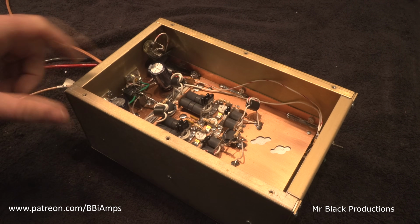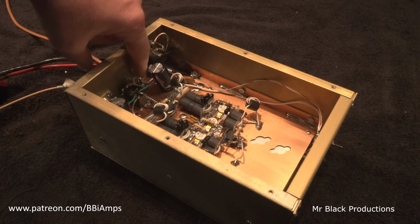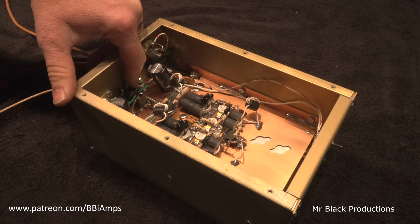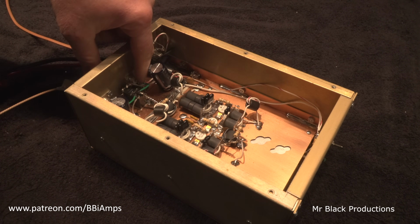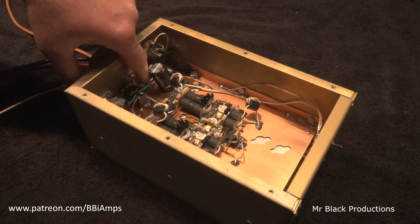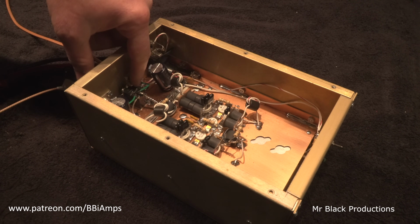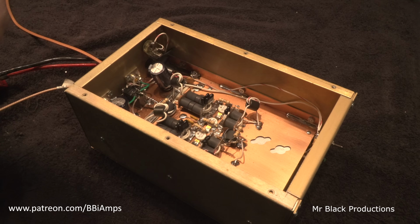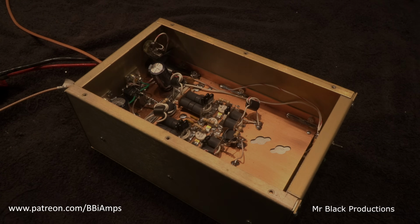There are a couple things here that scare me, like this solder blob that's right here, down inside the case. It's literally laying up against the positive switch wire for the on and for the remote. But they are touching. So that means 100%, the 1,000 watts this box could make, potentially goes right and literally is just the insulation thickness of the wire away from going completely kaflooey and making the box pop. So it's just amazing to me, just by looking, you can tell who built what and how it was built.